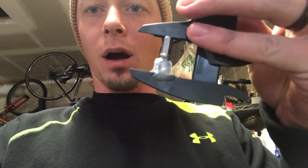I just finished editing the last video and realized I didn't go into detail at all about the math. I wanted to make it apparent that it's not hard — it's just simple adding and subtracting to get your desired measurement. I watched videos of people clearancing these by putting them together, taking a thousandth off, taking them apart, over and over. We can do it a simpler way with a ten-dollar caliper and a bit hot-glued onto it.